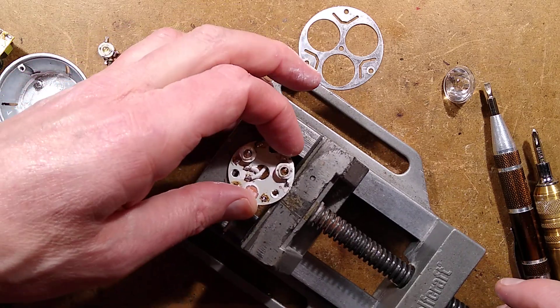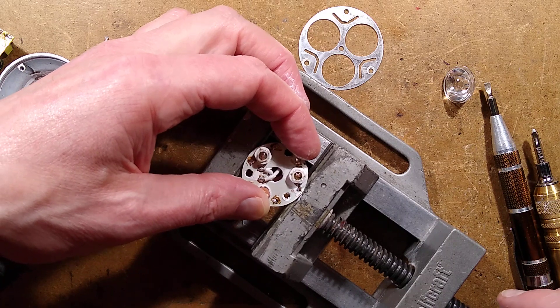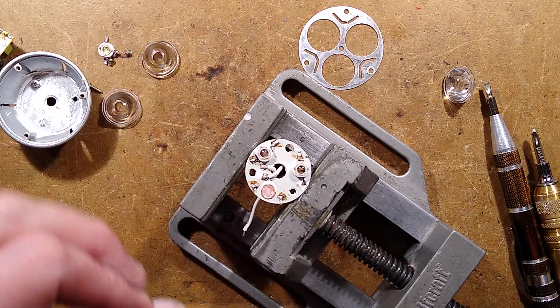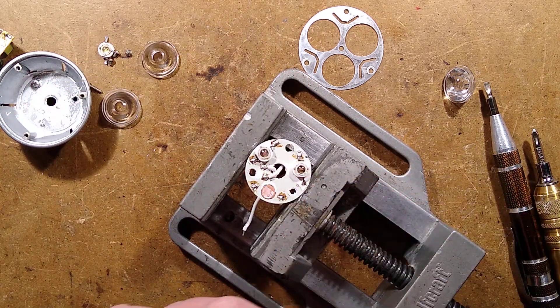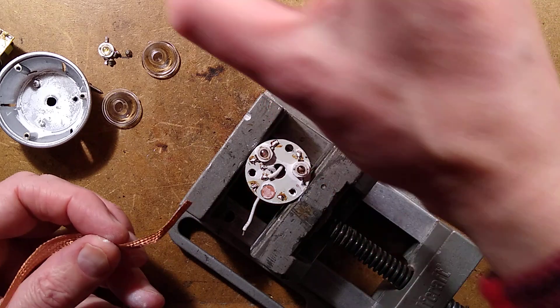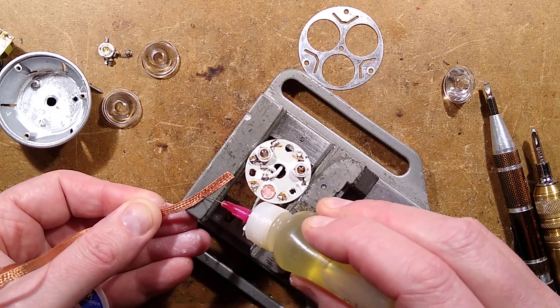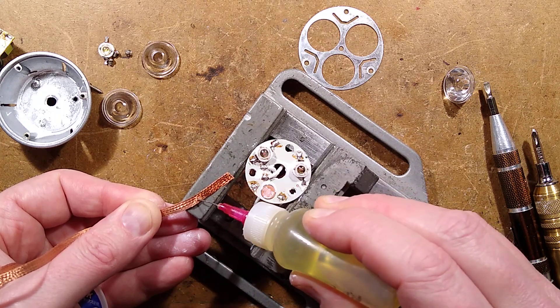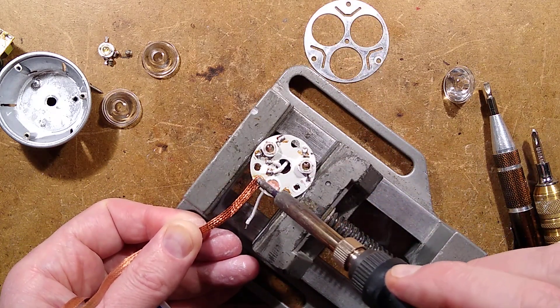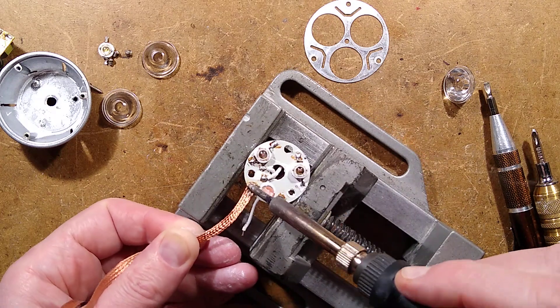I'm now tempted to change the red LEDs too, but I don't think I need to — they're still amply fine in output. I also don't think I've got any of the red LEDs in that format; I only tended to have the more interesting blue LEDs. Here's the desoldering wick — I'll add some flux to it and try to get some of this solder off. I'll add flux onto the strip; the tiny needle tends to block up a bit, but with a bit of pressure the stuff squirts out. Let's see if we can mop this off. I've just soldered the braid onto the circuit board — that's not bad actually.